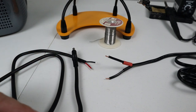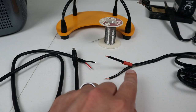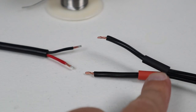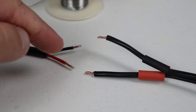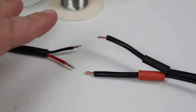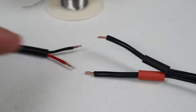If you're looking to build something more durable and longer lasting, this is option number two. We have this 5521 pigtail with exposed wires and the best way to connect this would be a solder connection. We have our fridge cable here - remember, the positive wire has the lettering on it and the negative wire has the ridges. I've zoomed in for the next step. I put the heat shrink on the positive and negative wires - make sure it's backed off so it doesn't melt, with a good solid inch between there. I've stripped back the wire on the pigtail to match the same length. We're going to pre-tin all four connections and then solder them together, then grab the heat shrink and melt it over.